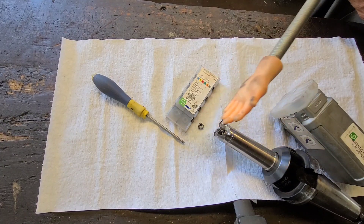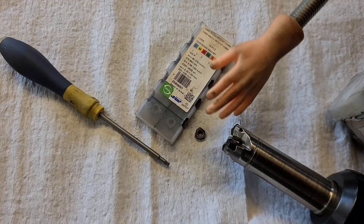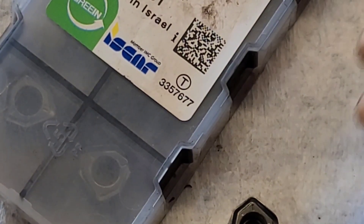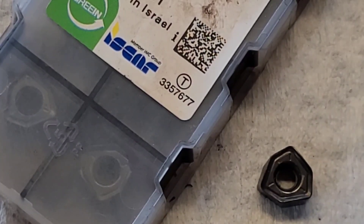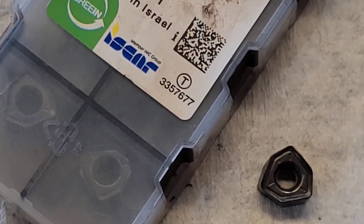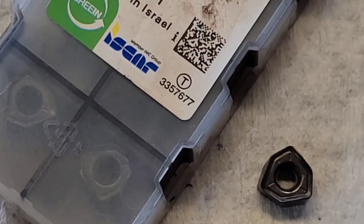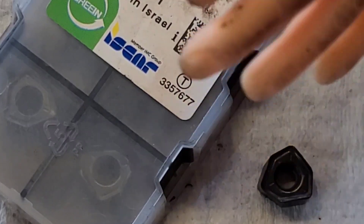Basically it just cuts in a vertical. The inserts are tangentially mounted, double-sided trigon inserts in a grip — the WXCU-05T312T in IC808. Recommended surface footage is 270 to 890, and I run them about 725, which equates to 3050 RPM and 100 inches a minute.